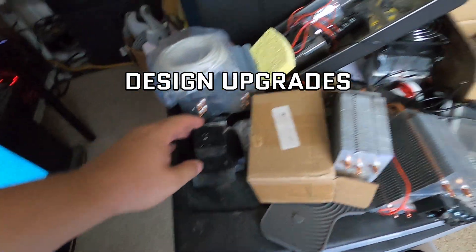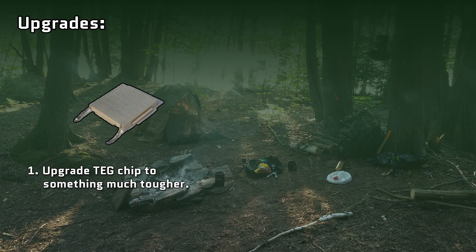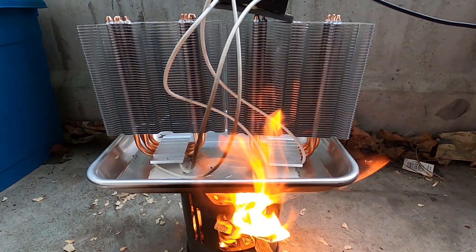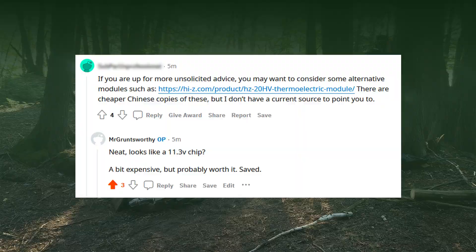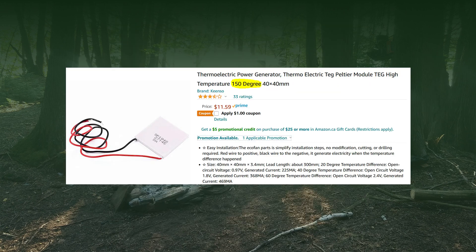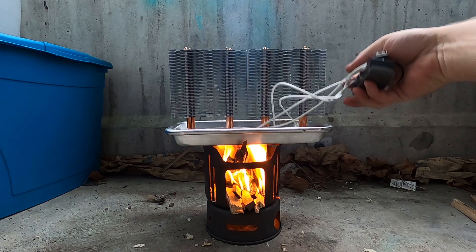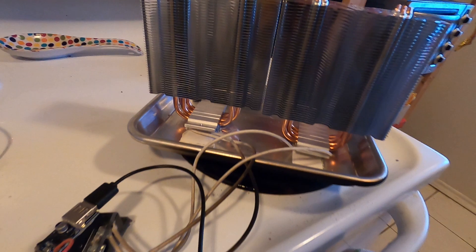After all of these educational failures I figured out the two main upgrades I needed to increase the durability and reliability. The first is that I needed a much higher quality TEG chip to withstand the higher temperatures, and the second is that I needed insulated wire for the same reason, including the chance that the wire will be exposed to direct flame. For the new thermoelectric generator chip I decided to go with the HZ2 chip from Hi-Z Technology, recommended to me by a helpful redditor. They make larger more powerful chips as well, but I went with the smaller 2.5 watt chips for this build. They can handle sustained temperatures of 200 degrees Celsius and intermittent temperatures of up to 400 degrees Celsius — a huge upgrade over the old chips that max out at 150 degrees Celsius. For the wires I went with fiberglass insulated wires that can handle up to 500 degrees Celsius. Aside from that I decided to keep the actual USB charger dongle separated so that I could either rest it on top of the heatsinks or completely keep it outside of the path of the heat as needed.